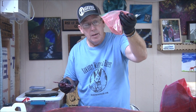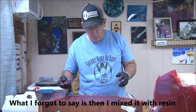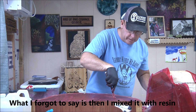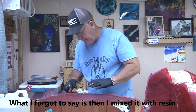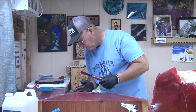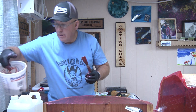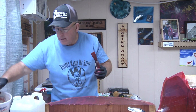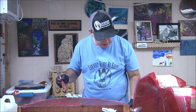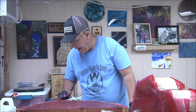I made a sawdust-pigment mixture, a reddish color. I ran out of red so I wish it were a little more red. I made it thick and shoved it down into all of the cracks. This is regular sawdust off of the planer that I sifted, then I added powder pigment and resin to make a paste-like compound — similar to what I did on my big shop sign but with pigment added.